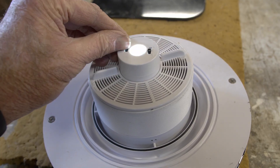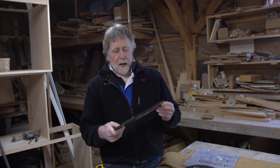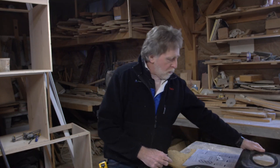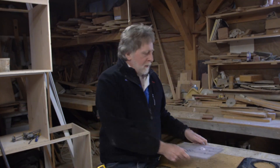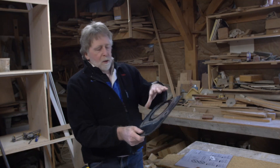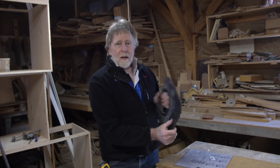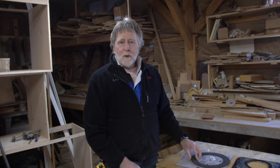It has a nice little light, but the only problem is it goes in the hatch and the hatch cover is a little bit small, so I need to redo the hatch cover with a new piece of Lexan, shift the hole over a little bit, and then remount the lock for the hatch. So I've got my work cut out for me.